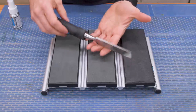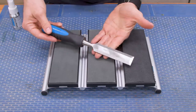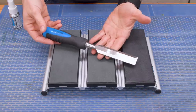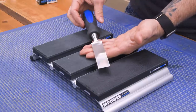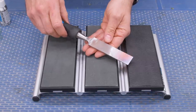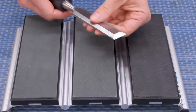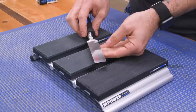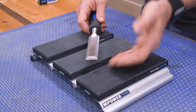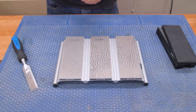This isn't really a sharpening tutorial, so I'm not going to go through 100% of the detail. Here's the chisel I'm starting with — believe it or not, this is an Amazon Basics chisel. It's not great, but it's fine. I've already done some lapping on it — it's fairly sharp to begin with — but we're going to repeat the process as if this were a new chisel, which means flattening the back and then honing that bevel. We'll start with the lowest grit and work our way up.